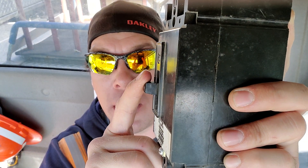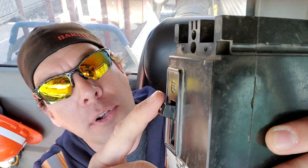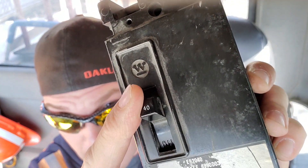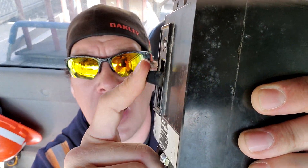Oftentimes we show up — which we don't mind — and it's just the breaker that's out. The customer goes down, they check the position of the breaker; it's sitting right about here. They push it up into the on position where it's generally labeled 'on' — you can see the 'off' there and the 'on' right there when it's fully up. But if that breaker tripped, when you push it up your power is not going to come back on. What you have to do is actually pull that all the way down into the off position, then all the way back up — boom, power's back on.